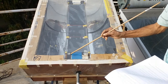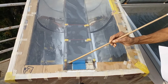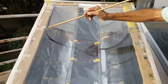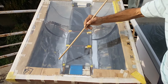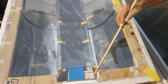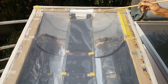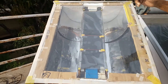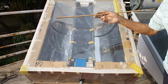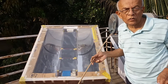The water tank should be painted with blackboard black paint which has a matte finish. These reflectors are made from thin aluminum sheets. I have used thermocol as insulation, but you can use rock wool, glass wool, or any other suitable insulating material to get good performance and to reduce cost.